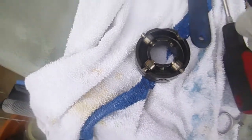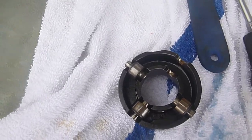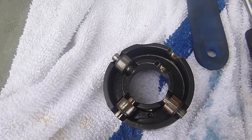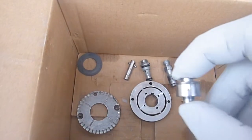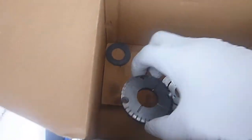I was actually considering that it may be a bad pump, but I don't think it's a bad pump. I think I could still go ahead and use it because there's no scoring near any of the compression areas of the pump. I've gone through and polished these guys so far — only one of the rollers has been polished, but I'll go ahead and polish up the rest of them and I've polished and cleaned all the other parts. They were extremely bad coming out of the pump.